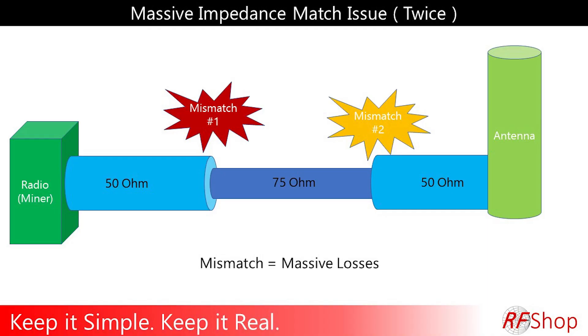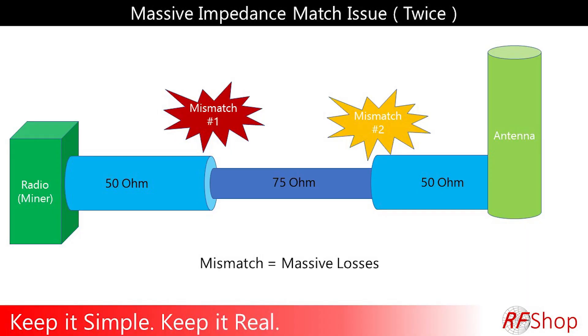On the other hand, TV systems are almost always 75 ohm — a different number. How this impacts you as a user is you have losses at the interface going from a 50 ohm to a 75 ohm system — what we call an impedance mismatch. If you think about waves traveling, they don't flow through cleanly at that junction where you go from your helium radio cable into your satellite cable. At those junctions you get a significant mismatch, resulting in a radio wave reflecting back and only a little bit coming through.